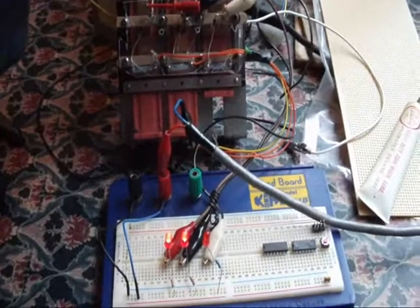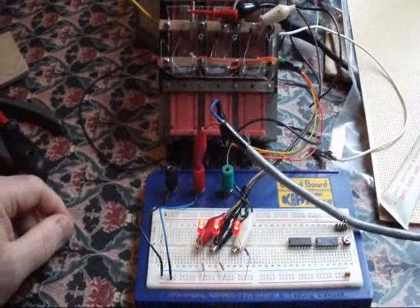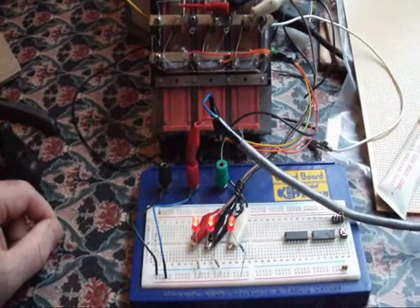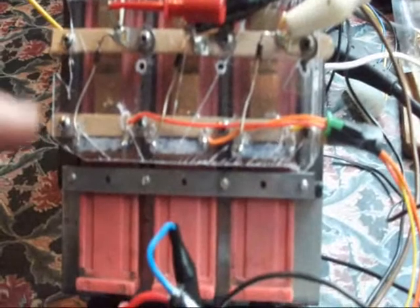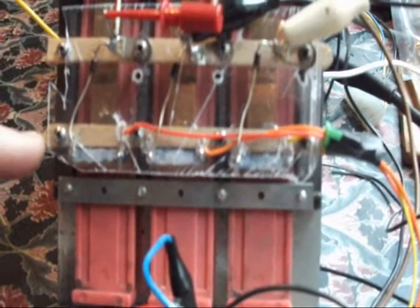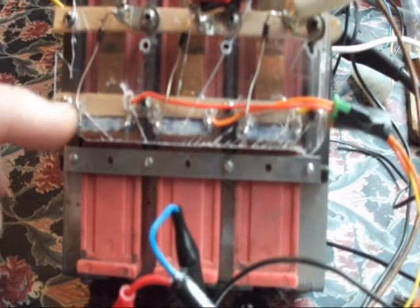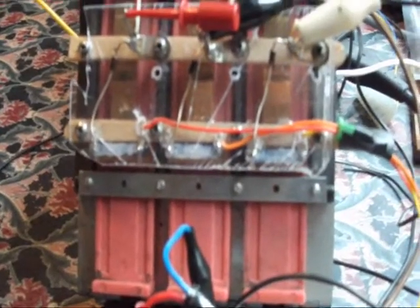These will need to replace the horseshoe targets and will become the series targets, or would work on a game from Firepower and later. The other thing you'd need to replace would be to create scoring switches and series switches, which shouldn't be too hard to do. The scoring switches would go in the middle of the window between these two coffee stirring sticks I'm using as spacers — so when the magnet passes it would score. The bottom three would be wired in series and become the series closer switches for earlier games. That's what I've done so far in the pinball lab.